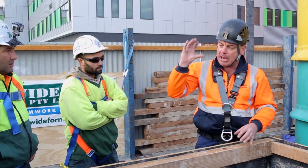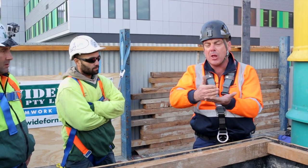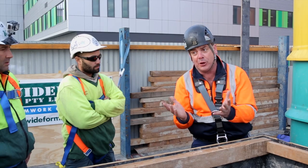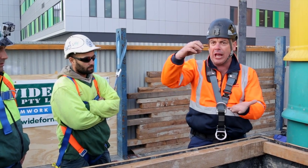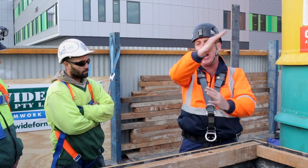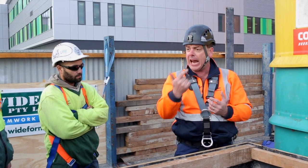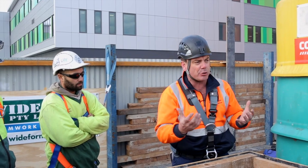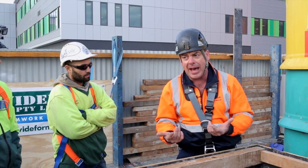So the whole idea of coming up with an engineering solution, where you're starting to cut these rescue doors so that you can open them up on subsequent levels, so you end up with a clear descent to ground, is going to basically revolutionise Jumpform rescue. You can imagine if we need to haul a casualty or lower them from level to level and then reset up the gear, because obviously with your traditional ladderways none of your openings line up, do they? So if you want to move a casualty vertically up and down, you're going to have to break gear down and set it up on each of those levels. As far as risk assessment goes, the more you break down something and set it up, the more inherent risk is going to be part of that, yeah?